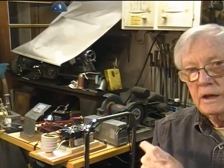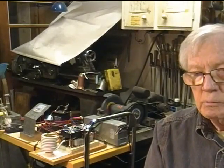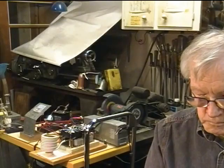with that I would be able to push the 2500 watt supply as far as you want to go. Obviously a 35 amp breaker such as what came with this isn't going to work for the DC power out. Just want to remind anybody who gets one of these with that power supply, it'll work as low as I think 72 volts AC, but it won't put out many watts. So I think it's still only 2/3 the power at 120 volts. So that's why I switched to 240 volts for this power supply.